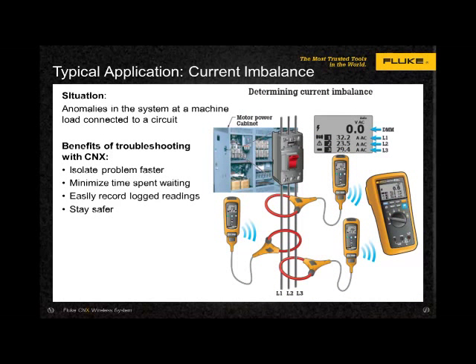Motors can overheat for a number of reasons, especially when there's a current or voltage imbalance. Is the problem with the adjustable speed drive or connections at a lug or in a raceway? For every 10 degrees rise in normal operating temperature, a motor's life can be reduced by up to 50%. So ensuring that all supply voltage and current are balanced can save unnecessary downtime and replacement costs. It was found that the L2 line on phase 2 had a loose lug on the output side of the breaker, causing a drop in current. The motor was working hard to compensate and unfortunately was damaged due to the single phasing type condition. This customer is now using this configuration in a predictive maintenance model.